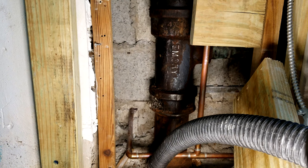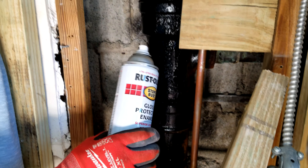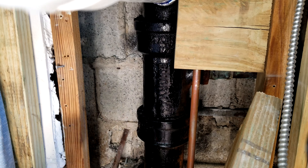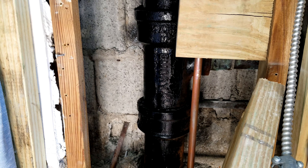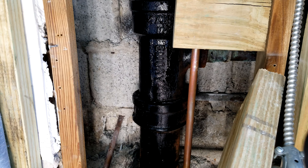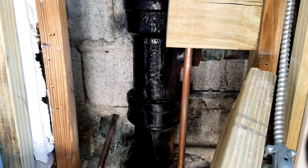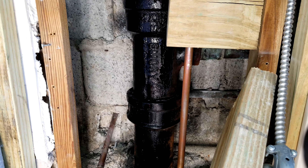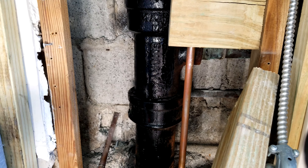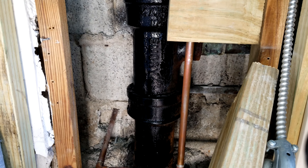And this thing should look pretty brand new by the time we're done. So we just finished the painting process. Normally you want to wait until the patch is done curing — that can be anywhere from four to six hours; you can let it dry overnight. Then we came in and sprayed the rust inhibitor primer on first, and then the paint. So this now actually looks like a brand new cast iron stack.